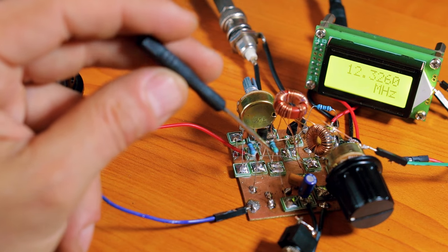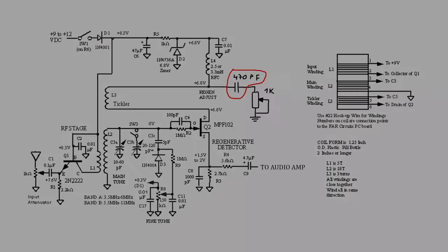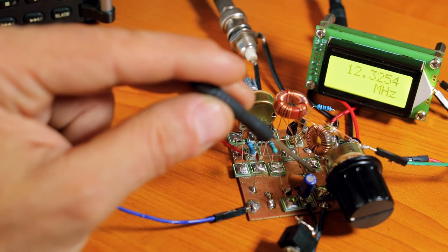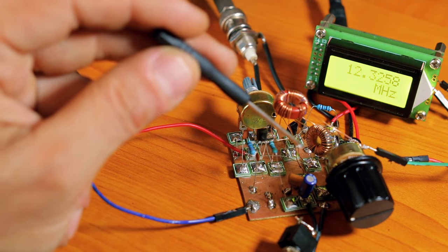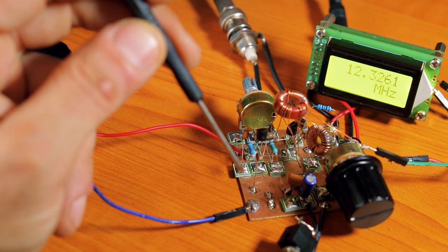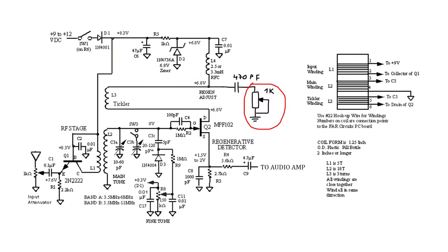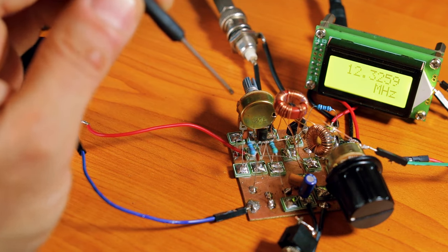Not wanting to go higher in resistor value, I decided to play around with the 470 picofarad capacitor connected between the potentiometer and the feedback coil. Dropping the value down to 60 picofarads didn't work, so I increased it from 470 up to 680 picofarads — we might fine-tune that later to get smooth regeneration control. The potentiometer I'm using is 1 kilohm; I tried 5 kilohms but it seemed too much. For now, 1 kilohm gives very smooth control and I like it.